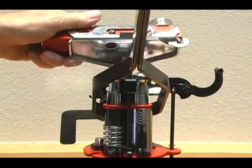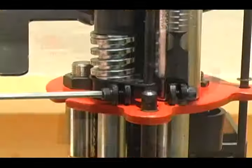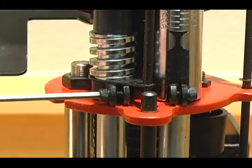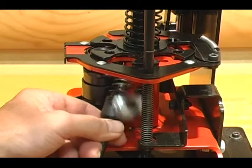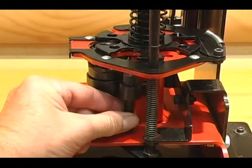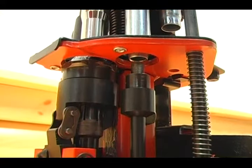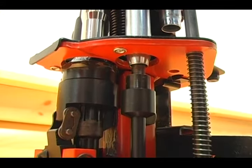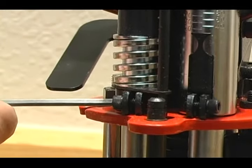If your bar is not releasing, the reprime tube is set too high. To adjust this, you'll have to loosen part number 507A Allen screw, remove primer seating assembly pad and spring, leave guidepost in machine, bring the handle into the down position. The reprime tube should be touching the top of the guidepost. Retighten part number 507A Allen screw.